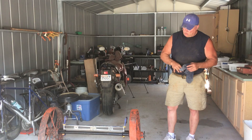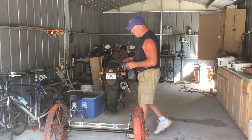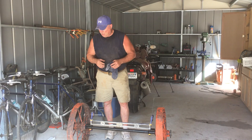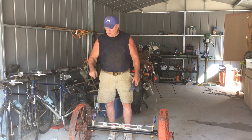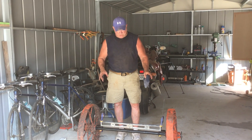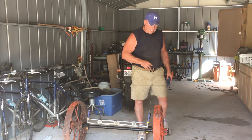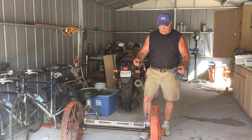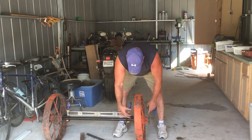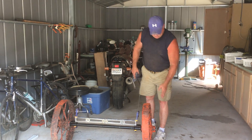Now it's an odd size, so I couldn't find pipe that was the exact right diameter. What I did was find a piece that was fairly close — the outside diameter was fairly close to the inside diameter of the hubs — and I welded them in as a sleeve on both of these wheels. Then I used a piece of inch and a half black pipe, threaded at each end, as the axle. The black pipe goes through the hub, inside of which is my shim — it's a bearing, for lack of a better word.